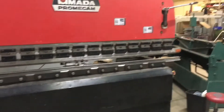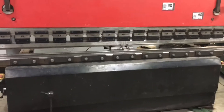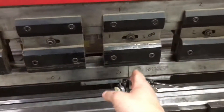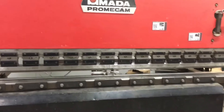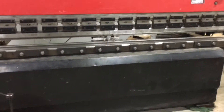Just a quick troubleshooting guide if you're getting uneven bend lengths — there are a couple things to check. The first thing you can do is when you set something up to bend it and it's, let's say, 8 feet long or 10 feet long, always best to bend it in the center of the brake press. I usually mark the center of my part and line it up within an inch or two, which helps create even force along the bed.